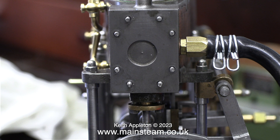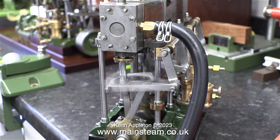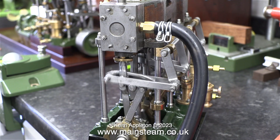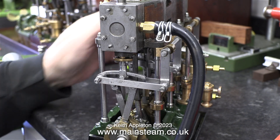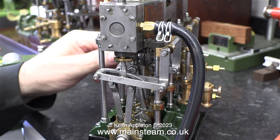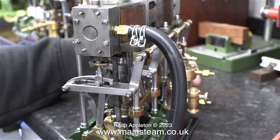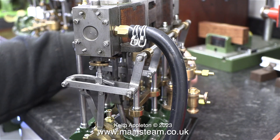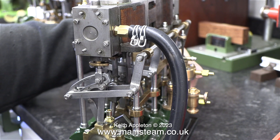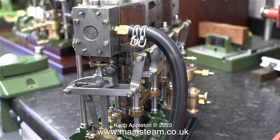Here is the engine just running using the first cylinder — the high-pressure cylinder. The timing is set correctly on the high-pressure cylinder and unsurprisingly it runs very well. The only problem is the eccentrics on this engine are made in pairs, so I cannot individually adjust each eccentric sheave to the position I need. When eccentric sheaves are made as pairs they have what's called the lead built in, meaning the pair of eccentrics are not at exactly 180 degrees to each other — they are offset slightly so that the steam is admitted just before top dead center. Running in the opposite direction was a complete failure.